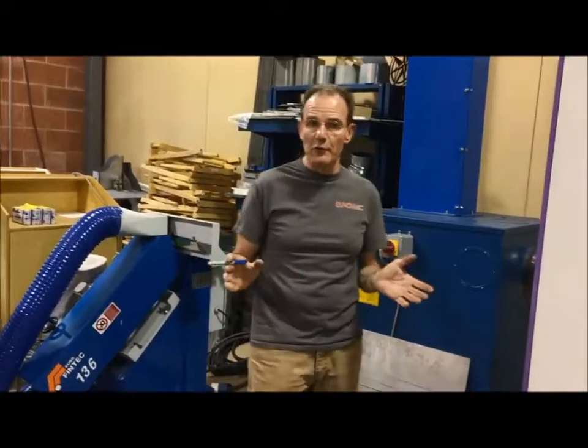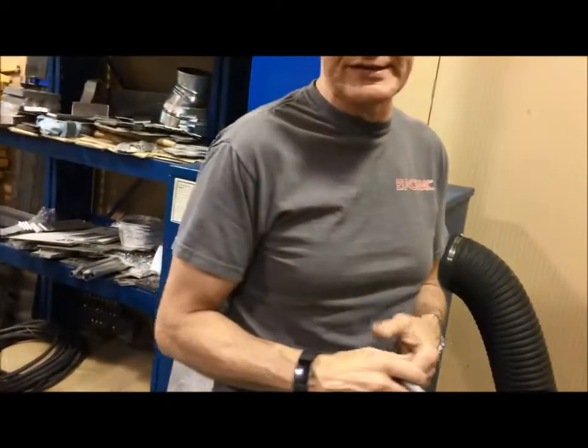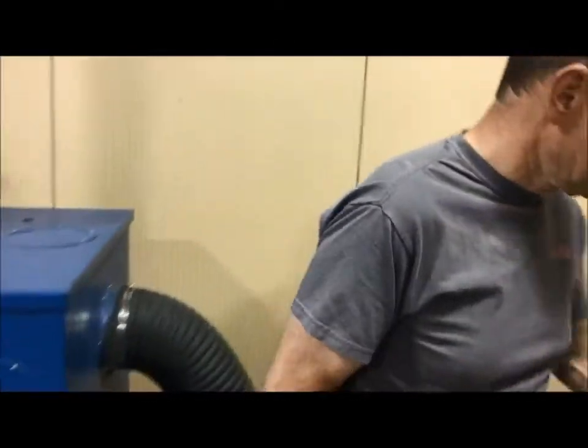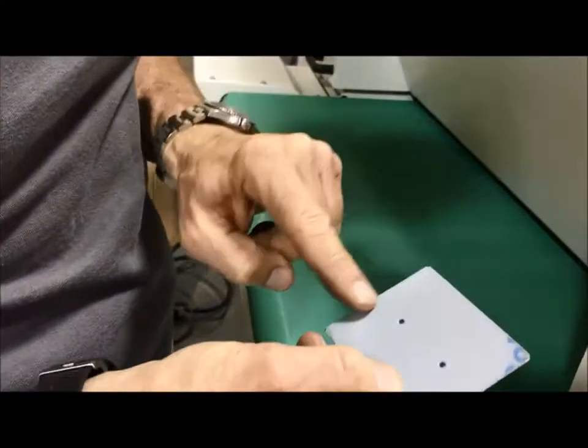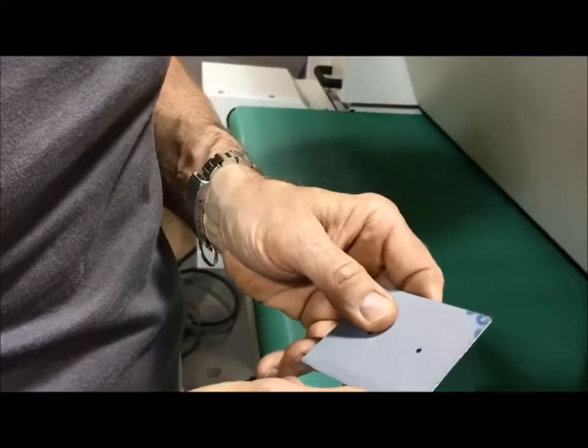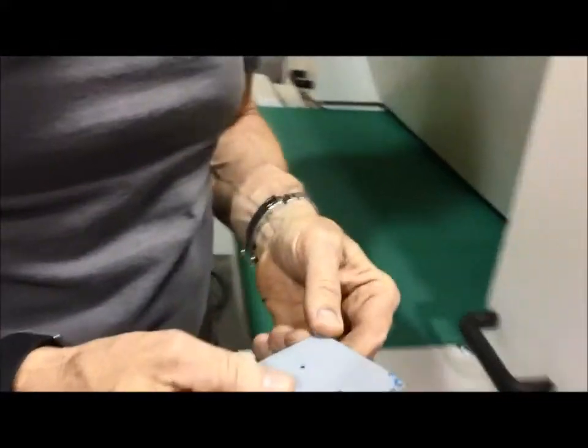So you have control over how much of the PVC you want to remove. In any case, you do not remove the PVC in its entirety. You will never rip it off where it gets wrapped in the machine. It will just grind away from the edges. So now here at 5 feet per minute, you can see the mark. We are removing material from the edges, but we haven't removed any of the PVC other than on this little corner where it was loose to start out with.